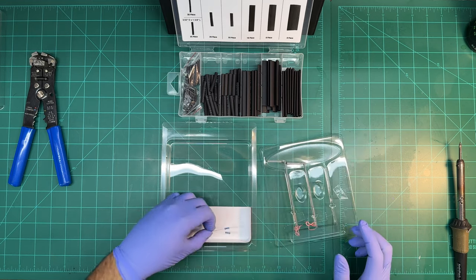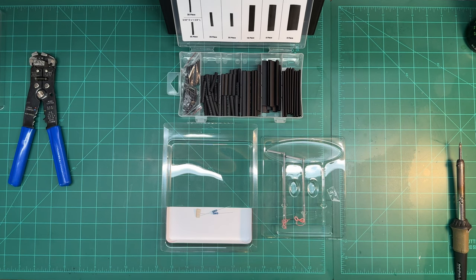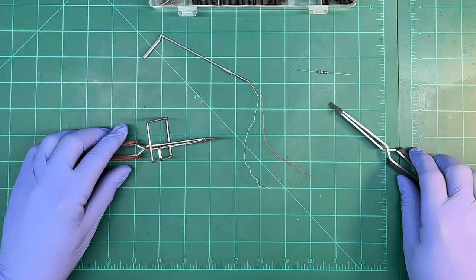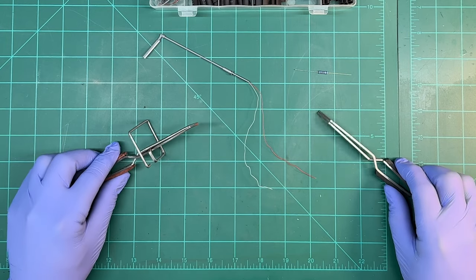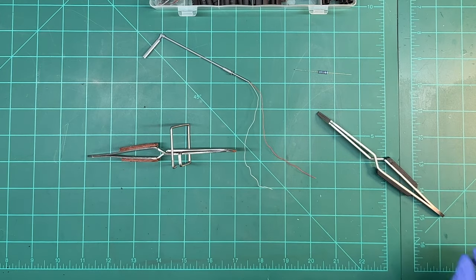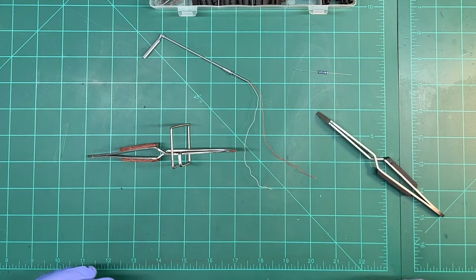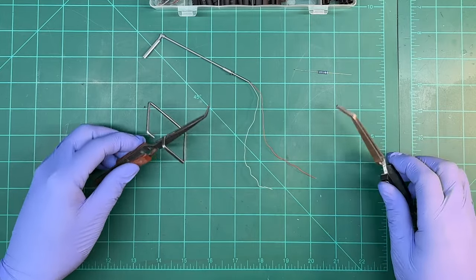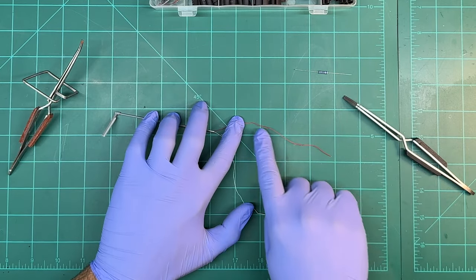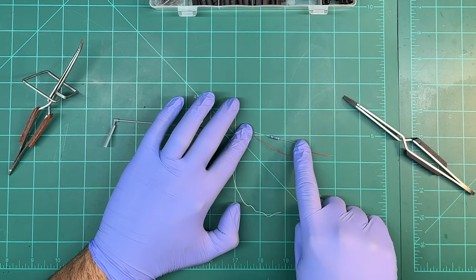In the package the resistors are separate from the wires, so I'm going to take these out, solder them up, and show you how to do that. Here we have the light, the two strands of wires, and here's the resistor. I have these two nice pliers - you can get these at Hobby Lobby. I use them so I can hold the wire and use the soldering iron at the same time without having to hold a bunch of stuff and burn myself or my mat. What I'm going to do is cut this wire and then wire the resistor in-line with the red wire.